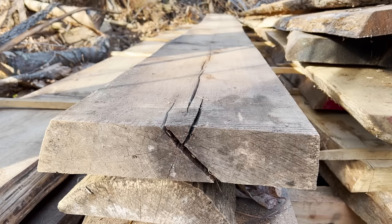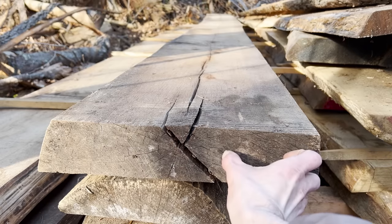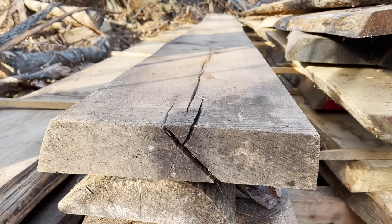And this piece of timber is wide enough to get the tiller out of half of this, no problem. And it's long enough that I easily have two tiller lengths in it. So in theory, this one chunk of hickory could give me four tillers. So I think I'm gonna cut it in half and bring all two pieces up to the boathouse, split them down the middle in the pith with the bandsaw, and then stick those four pieces in the corner and let them start to dry out a little bit more. And in a little bit, we'll run them through the planer and make them even smaller.